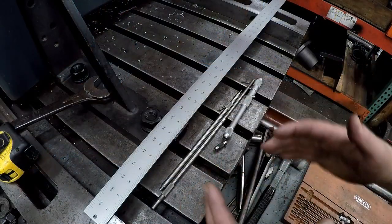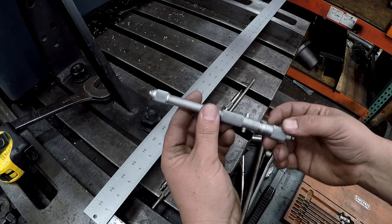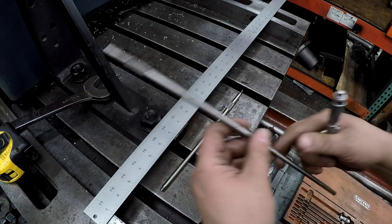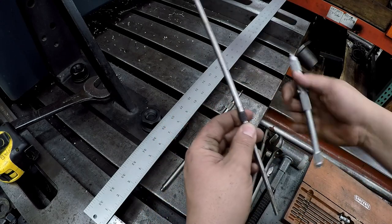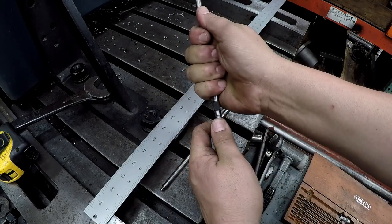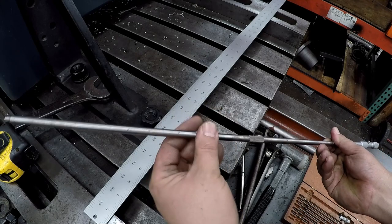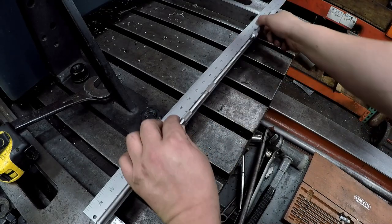I want a 27 to 28 inch range of measurement, so I'm setting this up to start at 27. We're going to use piece number 124C, then this extension here marked 26 to 32, and also the 1-inch spacer — so this right here will make it to 27 inches. We slide that on right here, slide this up inside until it seats, and tighten the collet down. Then we're going to use this extension that screws in to the end. I've got my 36-inch scale up here to verify it — it is at 27 inches. Alright.